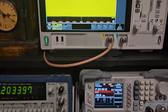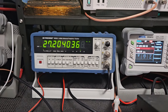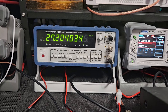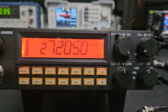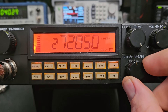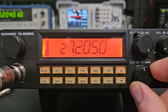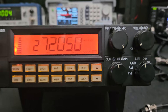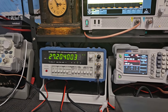Let's put a 1 kHz tone through it and see what happens with the frequency. Now we're starting to get aligned better. With the 1k tone on lower side we're only about 34-35 hertz off on the high end, and our clarifier is almost at dead center. So it's just one small little move. It does take a little bit to warm up; once it does it's pretty close.